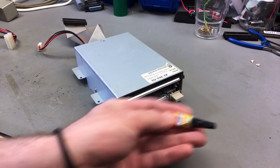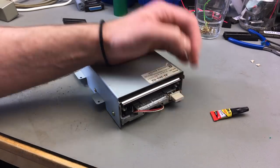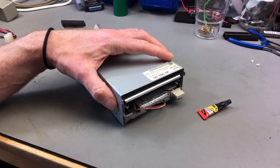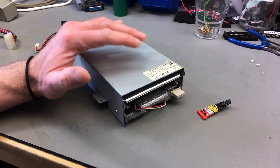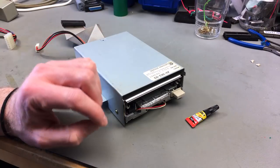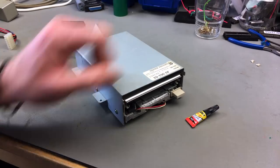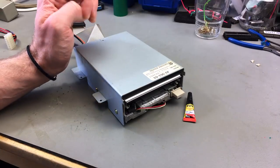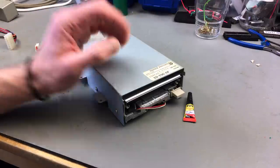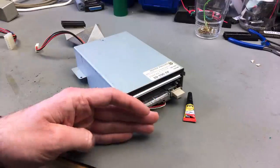there's better glue than this, and there's better filler, is what it's called, for filling gaps with cyanoacrylate-based glue. I am going to try some other stuff, but that's the stuff I have had lying around here. That was a pretty spontaneous idea, and it worked beautifully for this. So if you only have baking soda and a cheap cyanoacrylate glue from the supermarket, it's going to work reasonably well. But of course there is professional stuff that is used for model making and things like that.